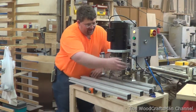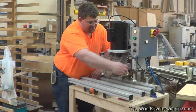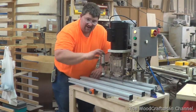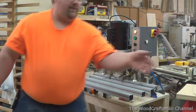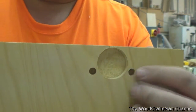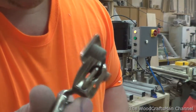One thing about this machine — and I'll bring it a little bit closer — is it has an insertion ram which you can kind of see here. Basically you snap the hinge onto here, push this down and cycle it, and it will actually insert the hinge after you've done drilling it. This is the hinge pattern. These holes are awfully big for pilot holes and that's because they're designed to use a hinge with plastic dowels on the back.